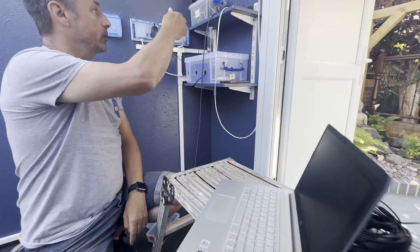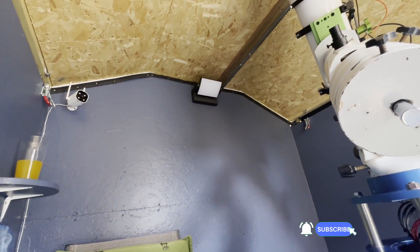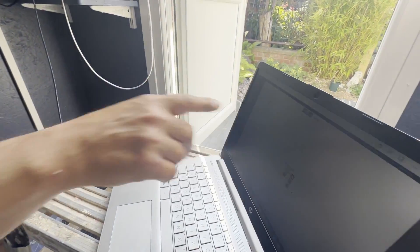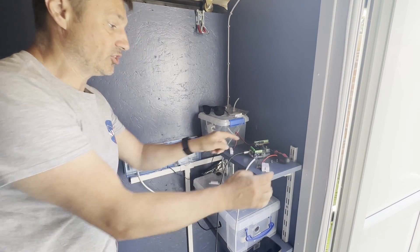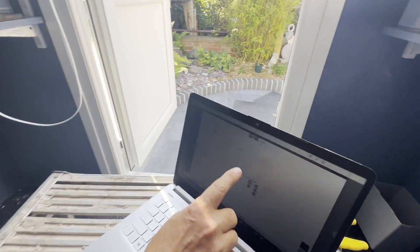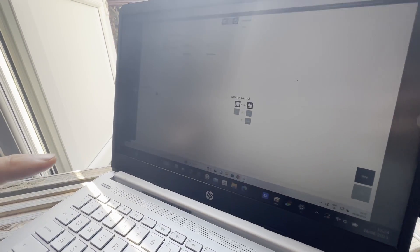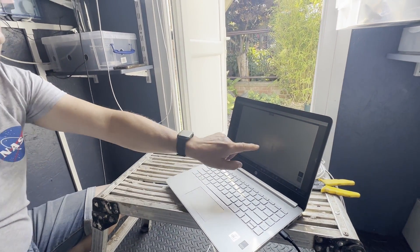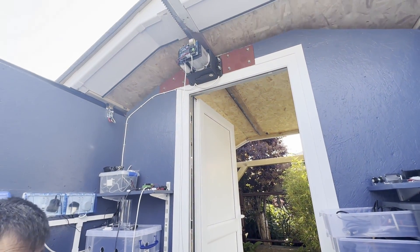It's working! And that's now the Arduino via your PC controlling your roof. That's awesome. And it's stopped. Then obviously it will say shutter open. Because when you've put it up, your magnet will then go to the other sensor. And you can see it turned the Arduino off because it's now saying that the roof is in the closed position, and on here it says shutter closed. Excellent. So there's your open and your closed. In your sequence you would tell it shutter open, it would open the shutter, and at the end of your sequence you just have close shutter and it will park your scope, do whatever you want to do, and then it will shut the roof.